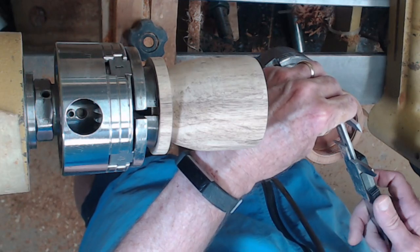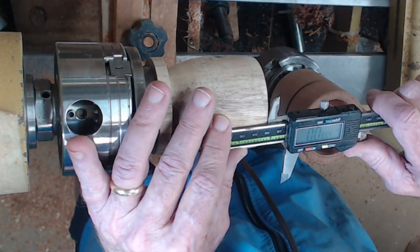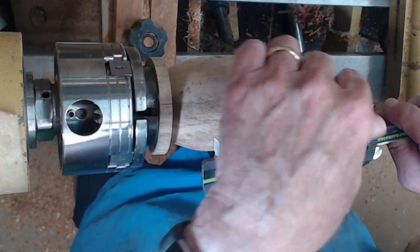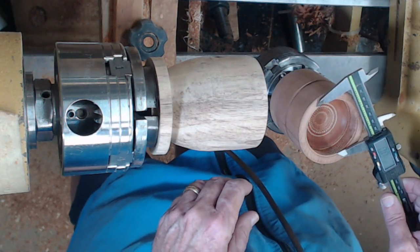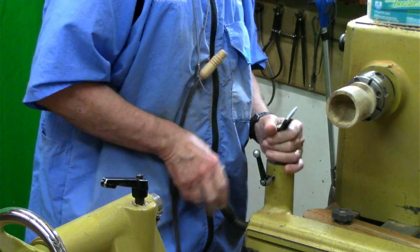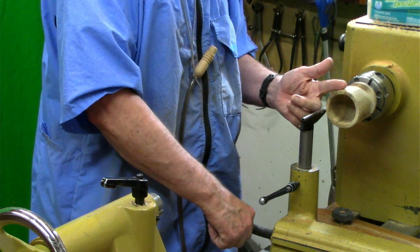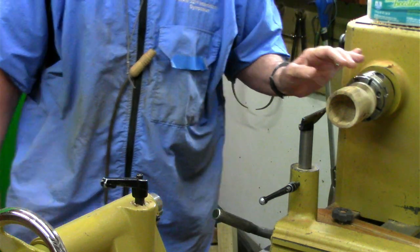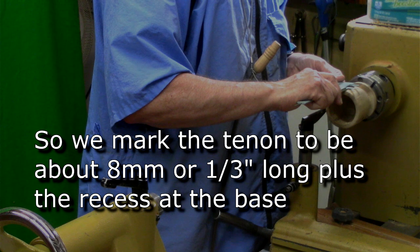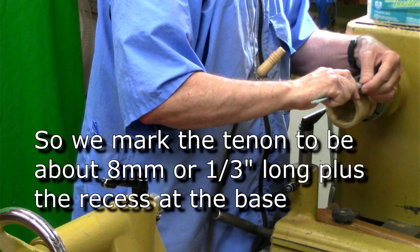I measure the inside of the female recess using digital calipers — once I get it measured, I can zero it out and add the appropriate factor for the threads, whether I'm cutting 16 threads per inch or 10 threads per inch as on this particular box. Now, how big does the tenon need to be? You need at least three good threads — not a whole lot more. So just a little less than a third of an inch; the easiest way to think about it is 25 millimeters divided by three, so just about 8 millimeters. This isn't rocket surgery.